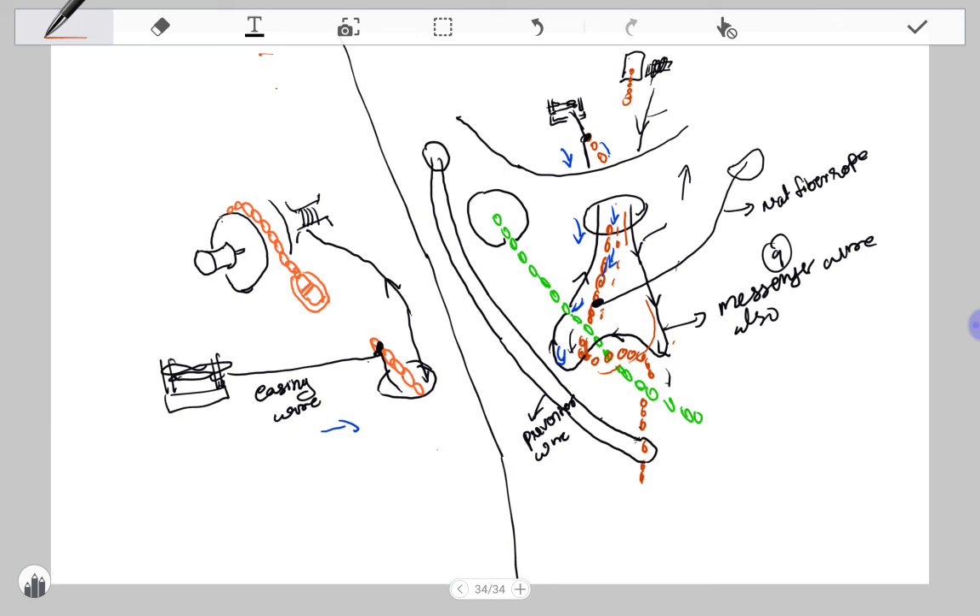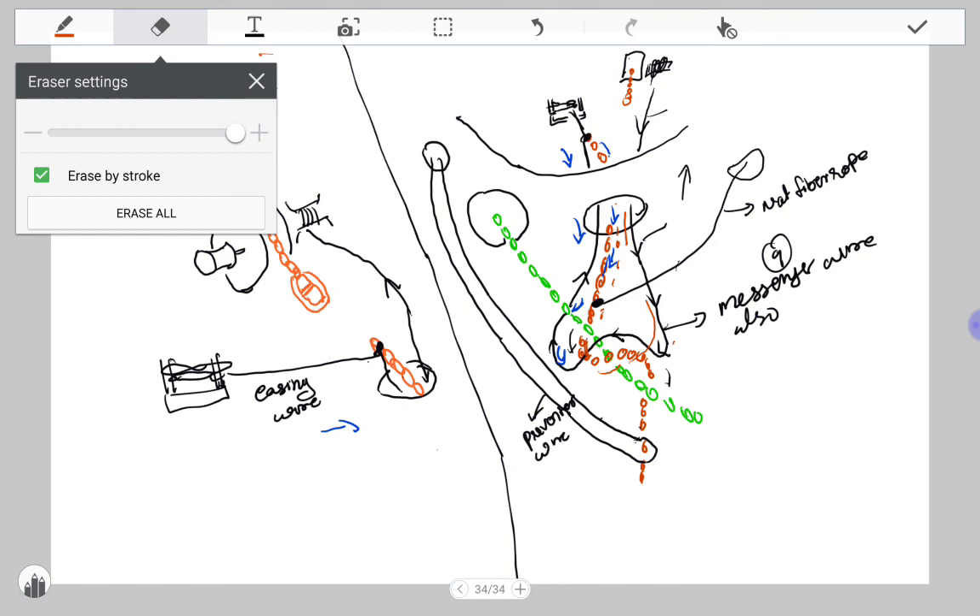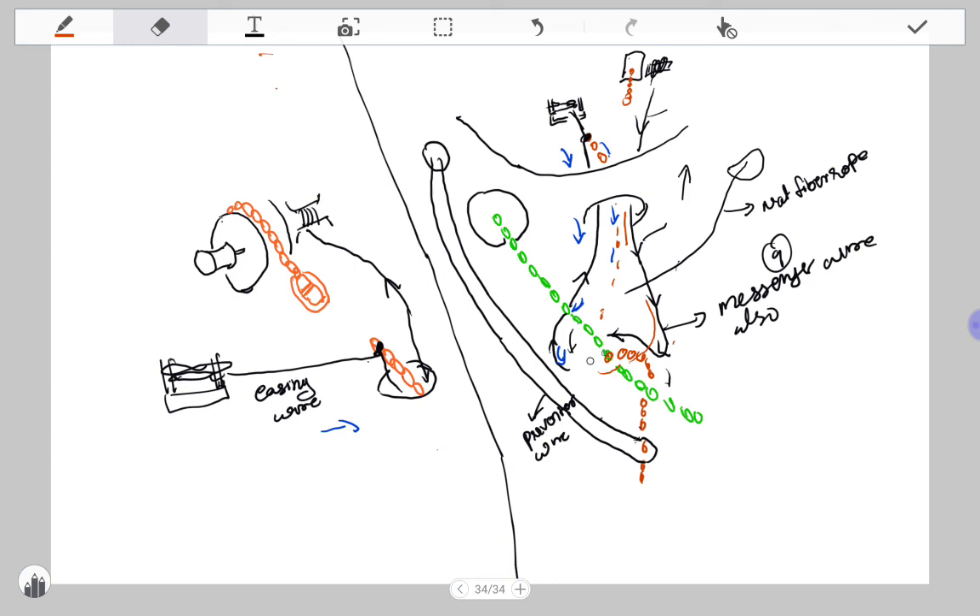By doing this procedure, one turn of the sleeping cable foul is reduced and removed. The sleeping cable now looks cleared of that turn. If there is another turn remaining, this method is repeated. This is the way you remove the foul of the cable. I hope you understood — try to watch this video and make notes by yourself repeatedly. Thank you.